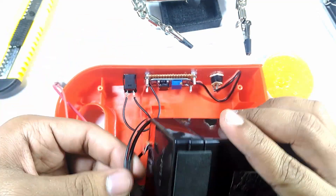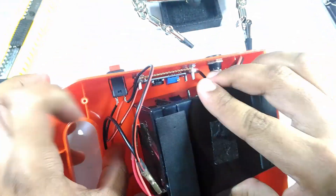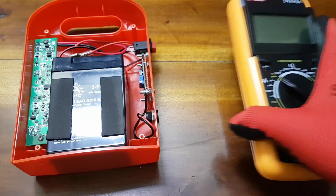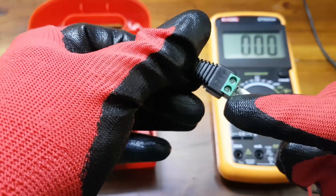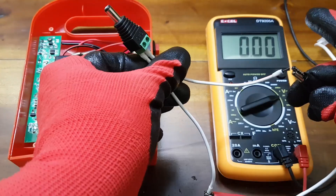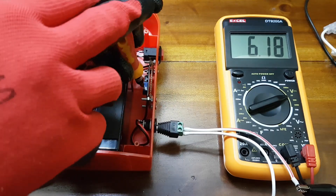After the charge controller was installed back in place, the circuit was connected to the battery. We thereafter need a voltmeter in order to adjust the boost converter to output 12V. After making the proper connections, the small potentiometer needs to be turned several times to achieve the desired output. For the MT3608, you need to turn it counterclockwise to increase the voltage and vice versa.